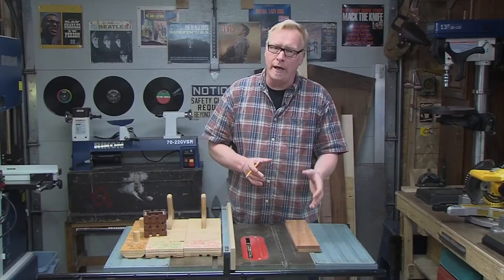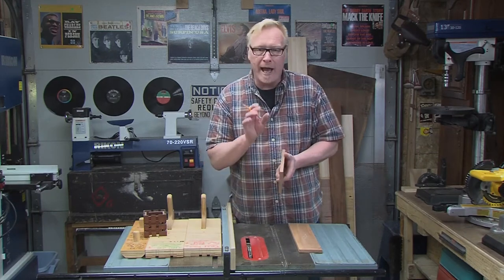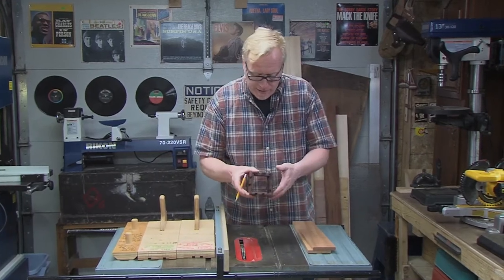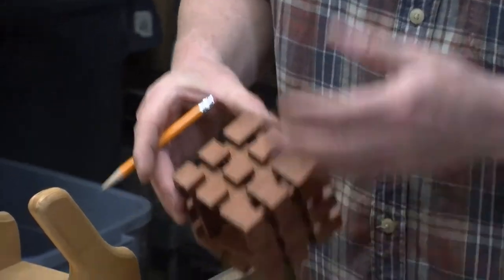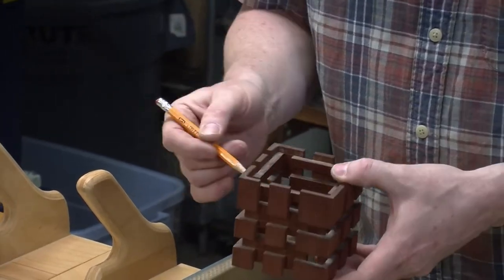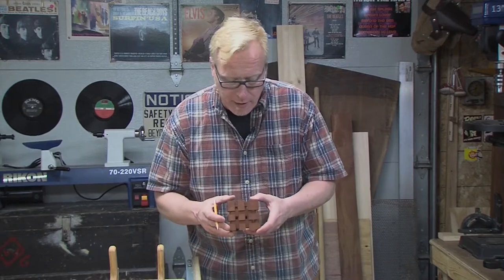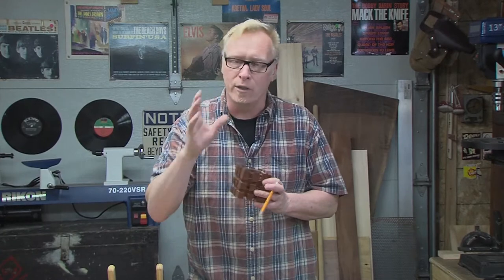We've dressed up our mahogany boards, cut them to 3½ inches by 15 inches and they're half an inch thick. Let's look at the anatomy of our tea light base. We're using mahogany — you can use any wood you prefer. Mahogany machines nicely and when oiled up it's a really nice-looking wood. We have four pieces all the same dimension. We cut them on a miter and glue them up. There's a rabbet on the top and bottom to accommodate the base and the perforated metal. The perforated metal emits the light — it hits the ceiling and looks really nice.